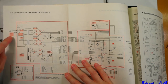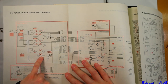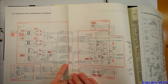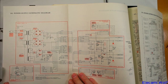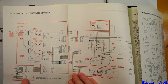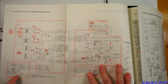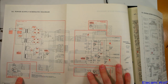So we've got: mains input plug, transformer, then two main bridge rectifiers, then a positive and negative type of thing going on off of one winding. There's AC 3.8 volts — that's what that other transformer thing does. That little one we were poking about just before takes the heater voltage, 3.8 volts, and generates another isolated 3.8 volts AC. And then that little regulator takes the 18 volts and turns it into a 15 volt supply.